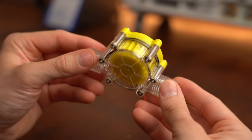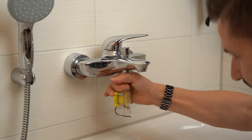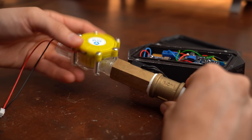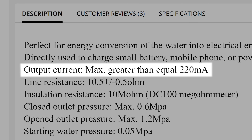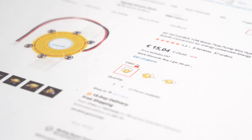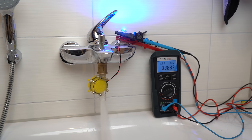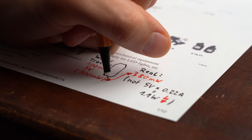The next product which got me interested was this water flow hydro generator for around €10, which you only have to add to your faucet and turn on the water to generate voltage at the output wires. Initially I wanted to use such a generator for my online water tracker project because the description stated it can output max greater than or equal to 220mA. I hoped that would be enough for the 100mA current demand of my water tracker, which also requires 5V to work — something the generator can also output. But after doing a practical test with a 1W high power LED, I was very disappointed to find out that the generator can at best only output around 380mW, which is quite a bit lower than advertised.